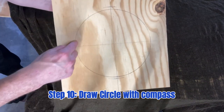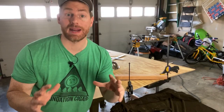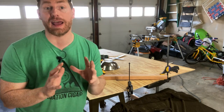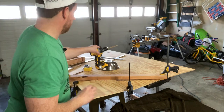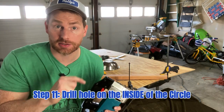And this is the hole that we are going to cut. By all accounts the best way to cut a circle is to use a circle jig with a router and the appropriate router bit. However, I'm assuming most of you will have easier access to a jigsaw and a drill. Also, I broke my router yesterday. So we are going to drill a hole at the edge of that circle and then use our jigsaw through that hole to trace around that circle.